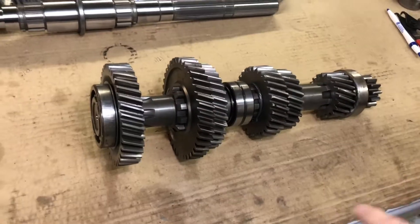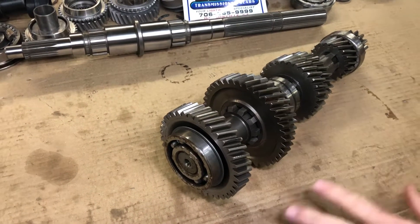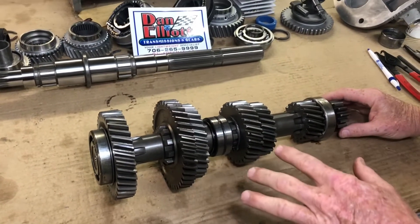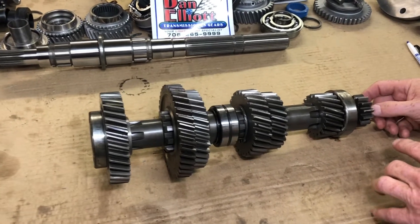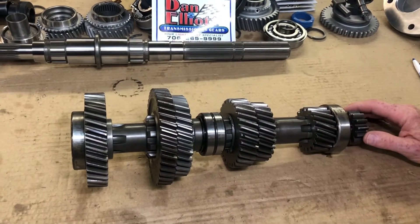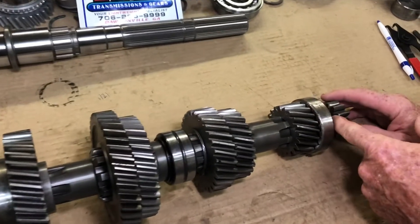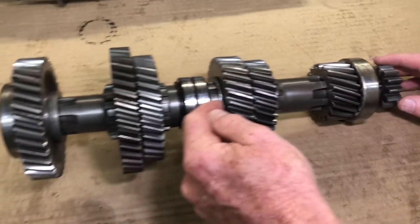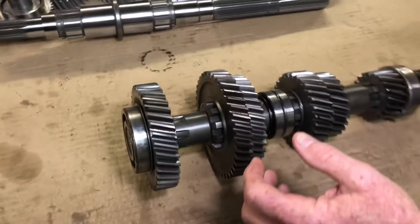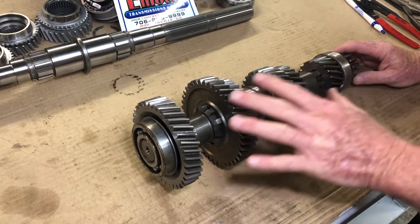It lifts out and comes to the bench. To abbreviate this a little bit, I think most of you are capable of doing what needs to be done next because it's just snap ring removal on the rear. Before we do that, I like to get my electric pencil and mark the fronts of these gears — the ones that you can get to — so that you know the orientation and how they ran. I like to pair them back together and put them back the same way.